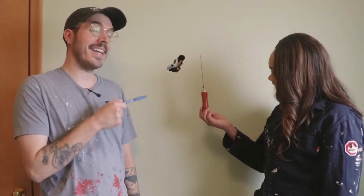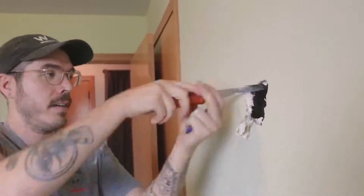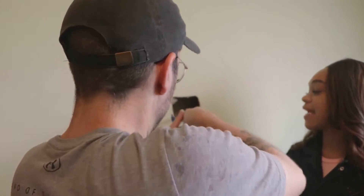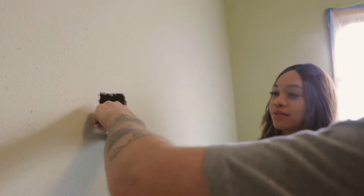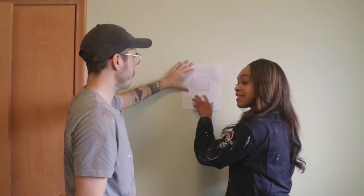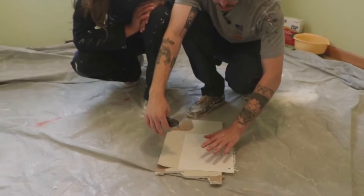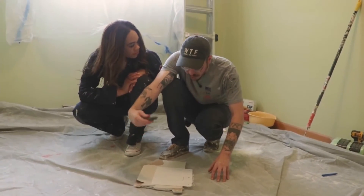With what's in your pocket. That's the drywall saw. So after this, what's next? I'm going to do a little tip and trick. This is a sketch for the hole — it doesn't need to be too precise. And we're going to use this to trace the filling precisely. So we're going to be using the trace paper and a utility knife to cut out the new drywall.